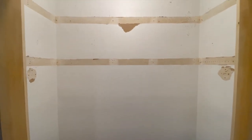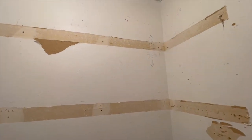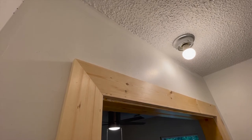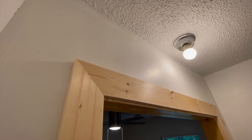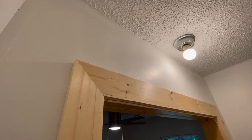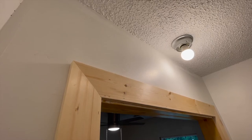I'm prepped and ready to put the cedar tongue and groove into the closet. I'm going to do the back wall first because I want it to be as tight as possible. You'll see some markings on the wall here — the wall kind of changes width as it goes up and down. In the middle it's 55 and an eighth; at the top it's 55. I put casing or trim on the inside of the closet as well, so we can have an edge for the cedar tongue and groove to butt up against, and it also finishes it nicely. The trim will be proud compared to the cedar tongue and groove. I used a metallic paint from Rust-Oleum to paint the light fixture there — reuse what we can, where we can.